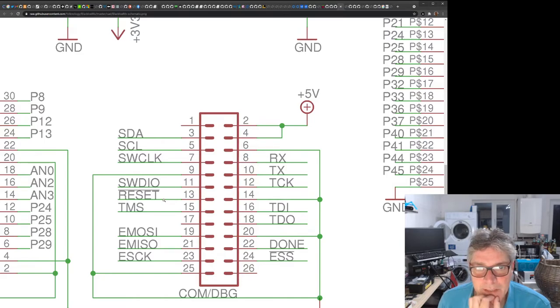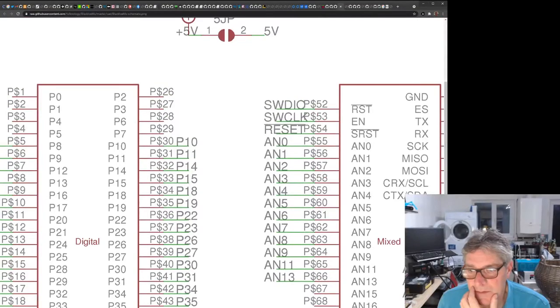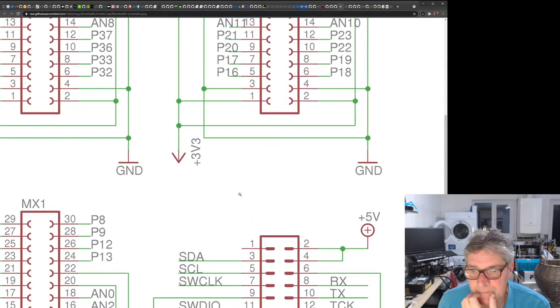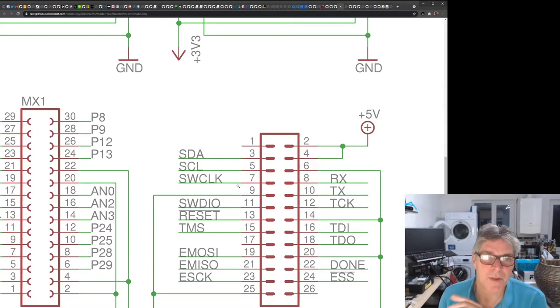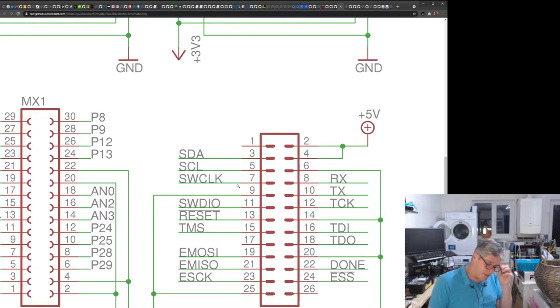And also, you could program it from the Raspberry Pi, I believe, in the early days. I don't think you can on this version because the chip select here is not the one that's used for programming. That's just connected, in this case, to a secondary one. But the earlier versions of Black Ice, like Black Ice 2, had a mux on the SPI, so you could switch between the Raspberry Pi as a device for programming it, or the STM32, if I recall. Testing my memory now.